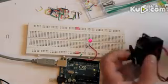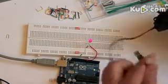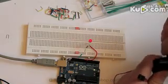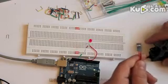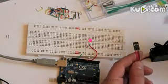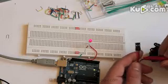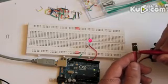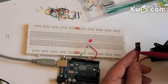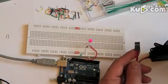So what happens is that in the servo motor there is a built-in controller, and we can tell the servo motor to which angle it should be steered. It comes with this attached cable, and we have 3 different cables in there. It is a red one in the middle. This should be connected to the 5V plus. It has a brown or a black wire. This should be connected to the ground, and we have a yellow or orange cable. This is the data channel, and it has to be attached to a digital output.